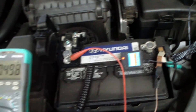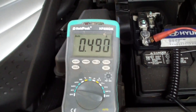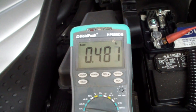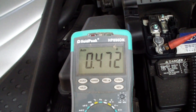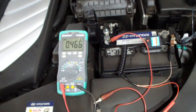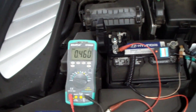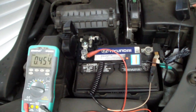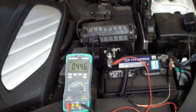I've got the charger plugged in and it's going through a current meter. This is a fully charged battery right now. When I first put it on it said 0.55 amps, and now we're down to about 470 milliamps. It seems to be going lower and lower. It's only been on here for about a minute, and I'm going to see how this thing goes over time to make sure that the modern electronics limit the current to not overcharge the battery for long-term charging applications.